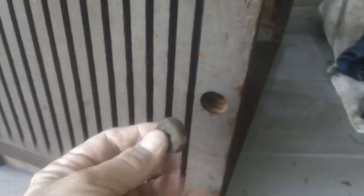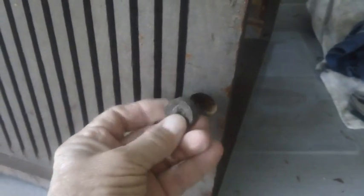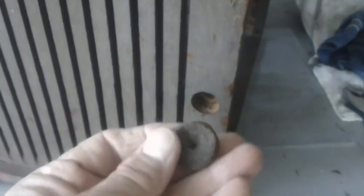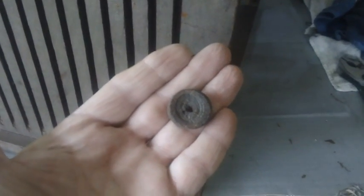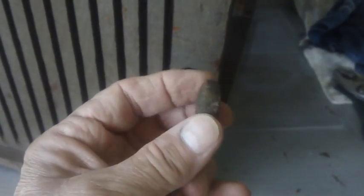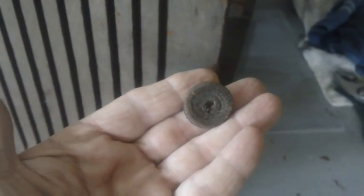Here's something interesting I just discovered while cleaning: there was a thick rubber bushing up in this hole — it's all hard now, a little flexible but not much — and it apparently had a screw and a flat washer that went up through into the bottom of the chassis and held the rear of the chassis down. I've seen this hole before but I've never seen one that actually had a cushion in it. We all learned something today! One of the rubber mounting washers from renovated radios might work as a replacement.